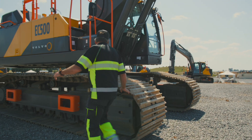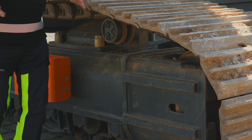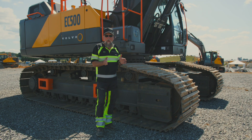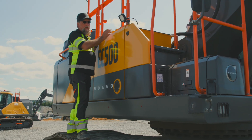If you come on around this way with me, you'll see some things we do differently here. These stiffeners that we put around the idler arm and also this U-plate make sure that the idler section never spreads out and has an issue in that area, and that's standard equipment on our machine as well.